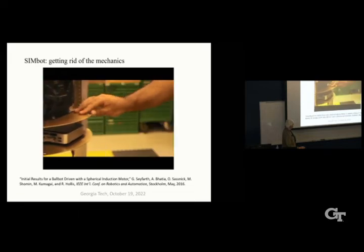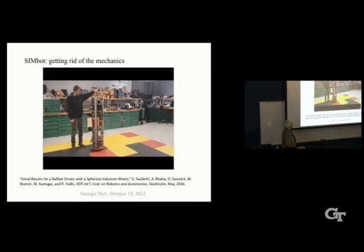When SIMbot is pushed or collides with a person, very small interaction forces can move the robot out of the way. Using odometry from three optical mouse sensors on the ball, SIMbot can also station keep. This means that unlike the pure balancing case, SIMbot will return to a position after being pushed. Note that like other ballbots, SIMbot is still physically compliant in this modality.